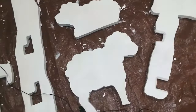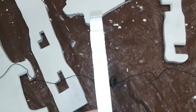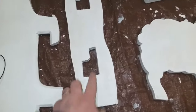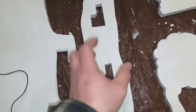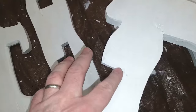Bryan and I made some modifications to the original plan, and the first was instead of using 1/2-inch plywood, we used 3/4-inch plywood, so a little thicker piece here. And that resulted in the need to widen some of the cutout pieces where it will fit together. And then we also chamfered some of the edges where pieces fit together to ease the fitting.